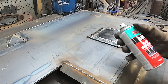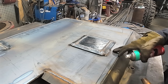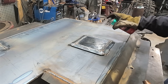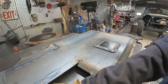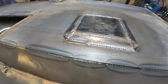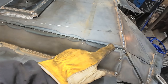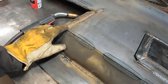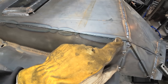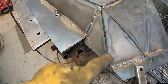This is anti-spatter spray — you put that on here around where you're going to weld and it'll keep the spatter from sticking. It makes cleanup a little bit easier. In all these other welds I'm going to turn down the heat a little bit because these are already welded really well on the inside. So basically I just need to pretty them up on the outside — it doesn't need to be a good structural weld, but I'm going to do that on all these outer sections.